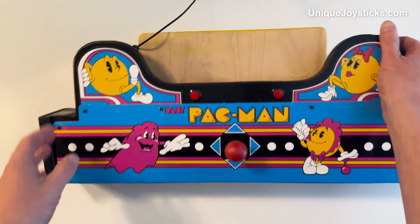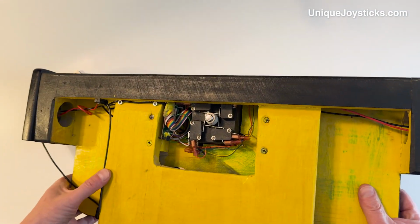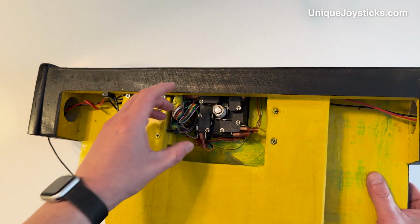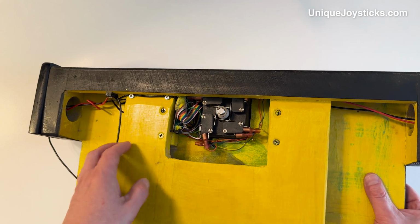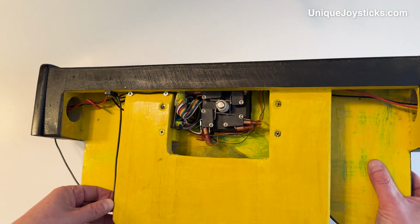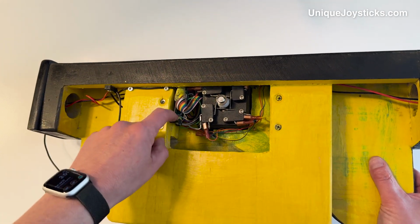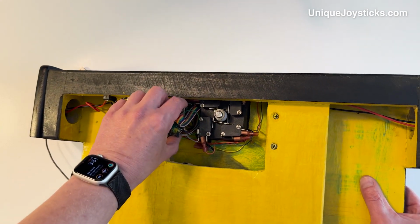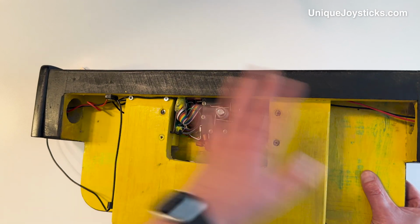And then the way that I've built it to work is that if I flip it over, it hooks in using a USB number pad, because Visual Pinball X has a little trouble reading from standard joystick inputs. You have to use a JoyToKey utility or something to convert that over to keyboard presses. So I bypassed that entirely by tearing apart a USB numpad and wiring directly onto the pins of the chip on there to hook up my joystick and buttons.